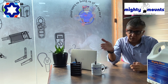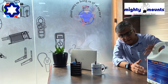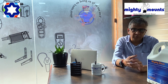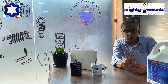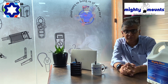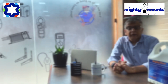What I recommend is, once you finish your copper pipe work, flush the entire copper pipe with Mighty Rinse in the same way described earlier. There is also a special instrument available for flushing, or you can simply use a normal funnel with a nitrogen flush. Just ensure before buying that it's Mighty Rinse. One word of caution: don't run this chemical through your brand new compressor. Thank you for watching.